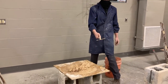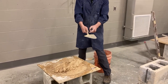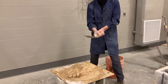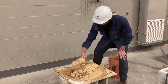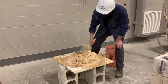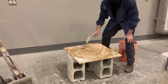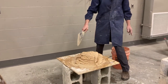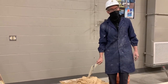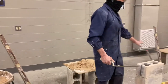When you're putting your mud down, the way you hold your trowel is extremely important. I hold my trowel with my thumb in line, literally pinching it right here. You don't want to spin it in your hand — you want to keep it still and the motion is in your wrist, like so. If you watch a mason in the real world, they're constantly working their mortar to keep it the right texture, because when we put cement in it'll harden fast and we have to work quickly.